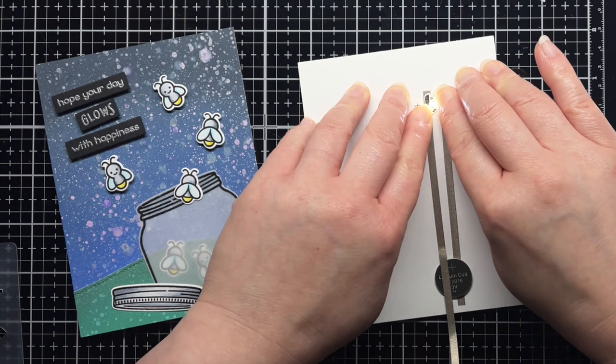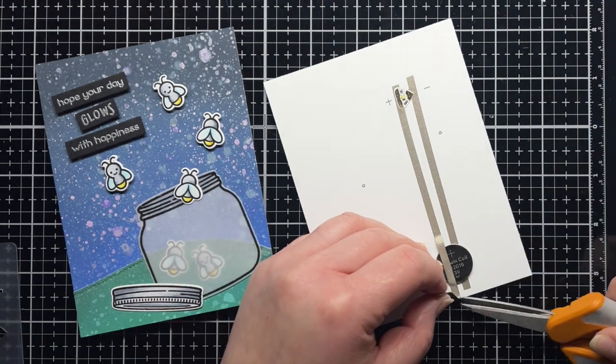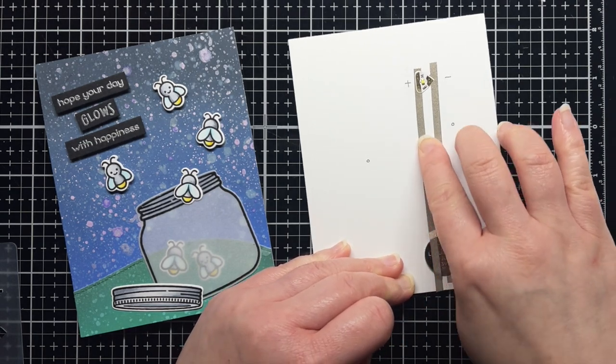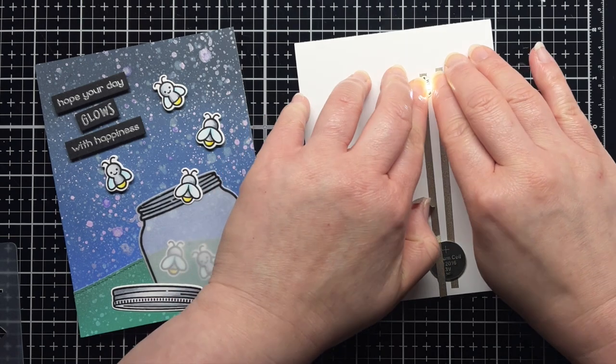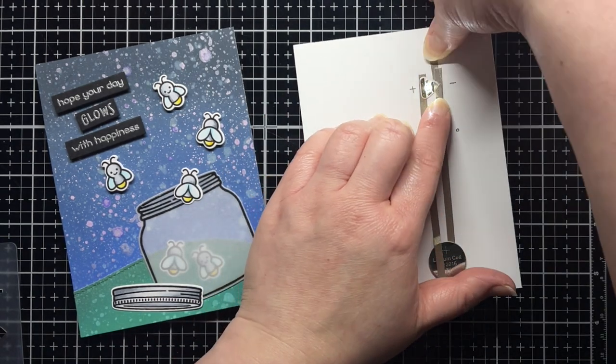As you can see, my light flickered a little bit, which is usually an indication that I didn't fully stick it to the conductive tape. Adding conductive fabric patches or small strips of leftover fabric tape can help make sure you have a good connection and that the LED sticker won't shift or flicker.